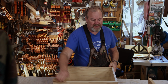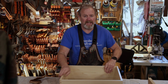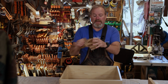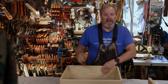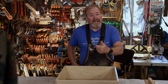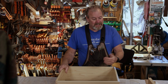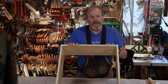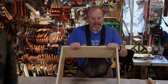Super quick and easy. And that way if the client happens to grab one of these drawers when it's sitting on the ground, they're like, oh man, that's nice and smooth. That's another tip from Mr. Kevin. Brown paper bag, rosin paper works really well. Wipe it down a little bit, super smooth. Everything feels wonderful, and life is good again. Another tip from Mr. Kevin about building drawers and making them the most awesome drawers ever. You can spray the most awesome drawers ever. You can build the most awesome drawers ever. When it comes down to it, if your drawers got overspray all over the place and your client feels them and it feels like a rough corn cob, that's not good.